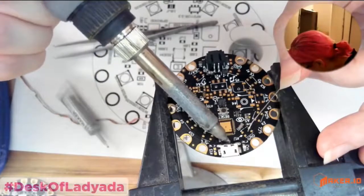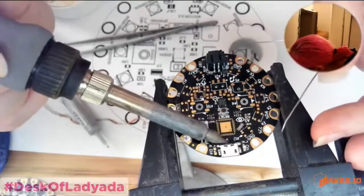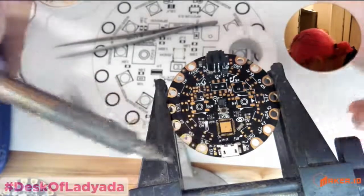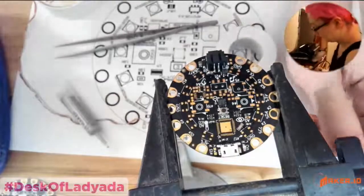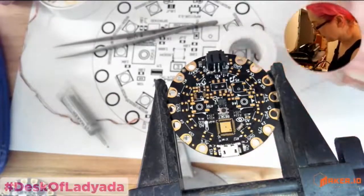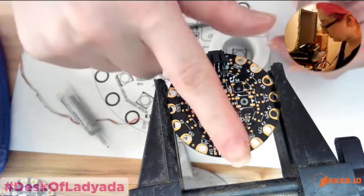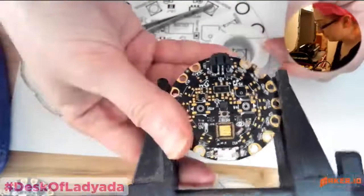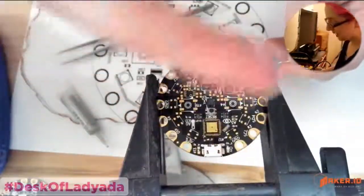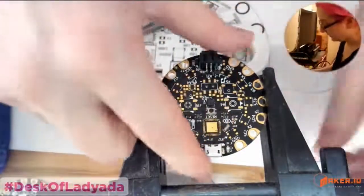And do you recall which one this is that you like? Because this is going to get USB cables plugging and unplugging quite a bit. Sorry, what was the question? Do you recall which connector this is? Oh, it's one of the ones that's mixed surface mount through hole. I don't remember the exact part number, but they have them on DigiKey. Just look for ones that have four legs that go through the PCB.